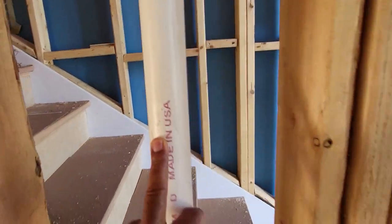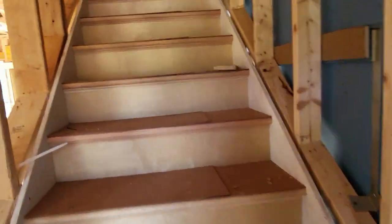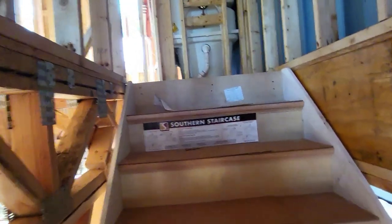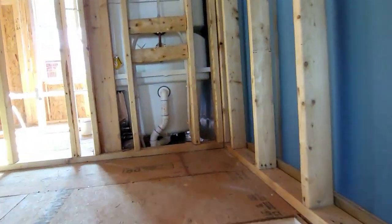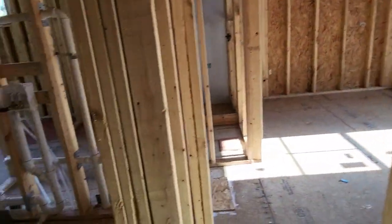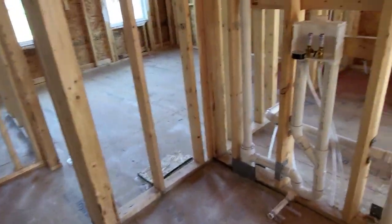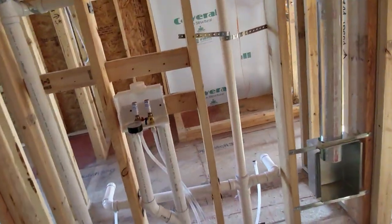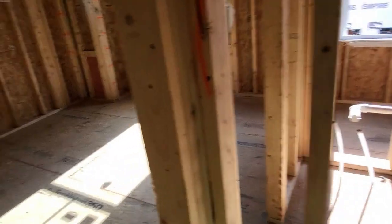After all the plumbing is roughed in — and that's a vent line — let's go up to the top floor. All that PVC piping is roughed in and distributed to all of the fixtures throughout the house. A plumbing pressure test is when you fill all of the piping up to test for leaks.